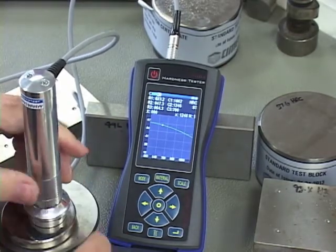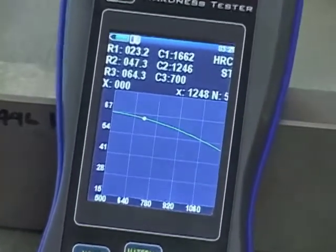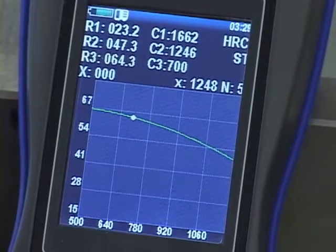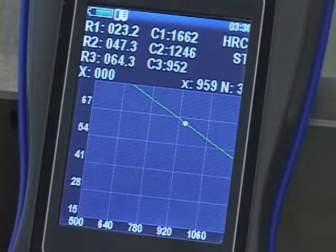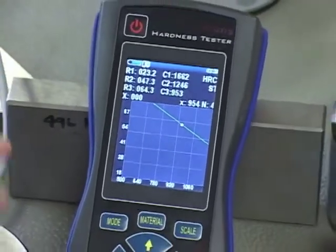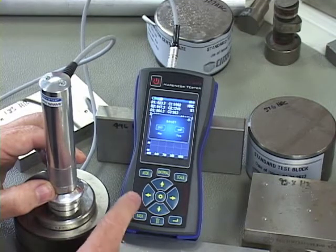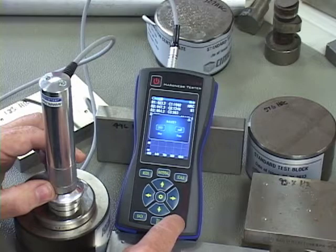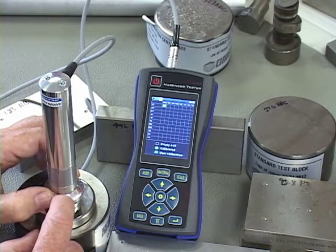Now I move to the third block, which is a 64.31. I ring it to the heavier part, move my cursor down so that line is yellow at 64.3, and perform three or more tests: 946, 949, 952, 953. The calibration is now done. To store it in the probe's memory, I hit the backspace button. A prompt comes up asking whether to save the calibration — hitting back would be no, or as the icon shows, yes to save. The display scrolls and I have now calibrated this test probe for steel using those three test blocks.